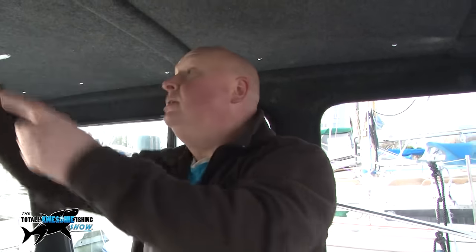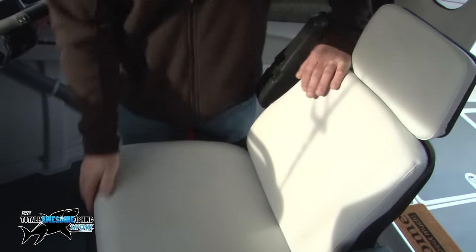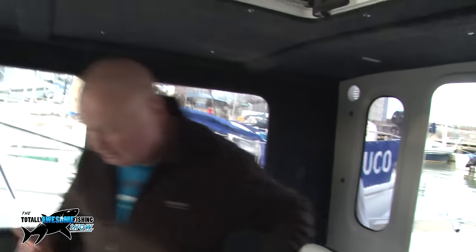The interior surface covering is just six-millimetre plywood panels covered with acoustic carpet — the same stuff used in car audio installs. It's not cheap, but you can get it at a good price. The headliner right around the wheelhouse was done in one piece by a specialist. There are little plywood blocks bonded into the GRP so you can screw the panels to them, and wires run underneath hidden away. The suspension chair was only £240 — compared to over a thousand for a cab-spec one — and it works well.